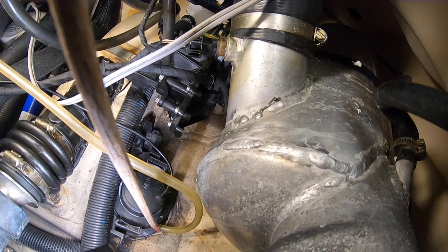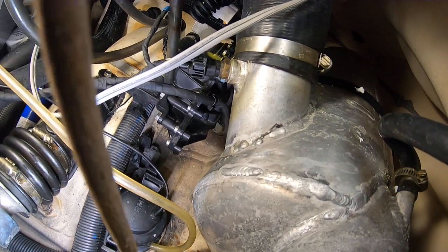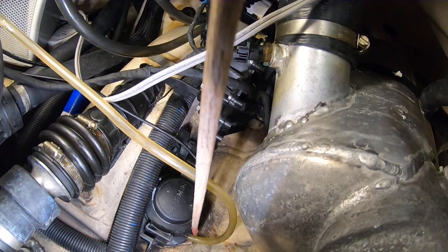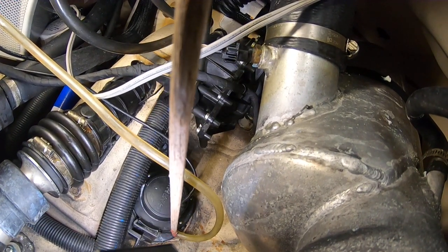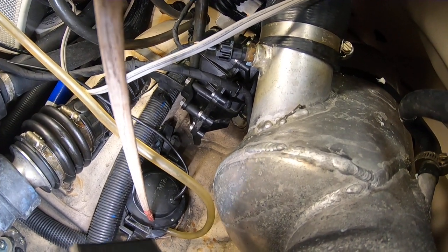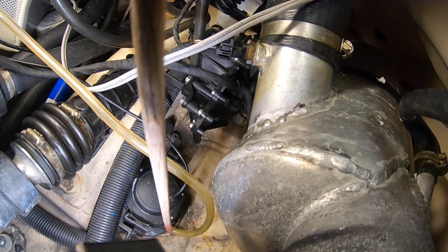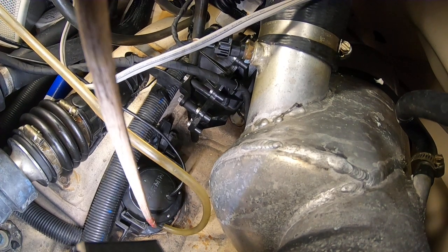When I checked on my further problem, although I had fluid in my tube, there was a tiny bubble down in this area right here. That led me to look at it from the side and see that the bubble might be interfering with the readout of the transducer. Apparently if any air gets in between the transducer surface and the hull surface, the transducer doesn't read very well.